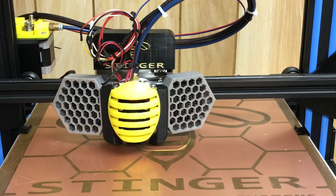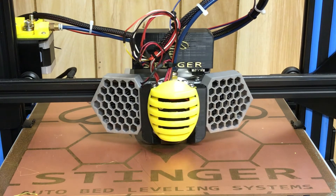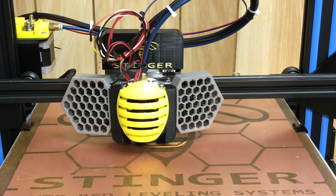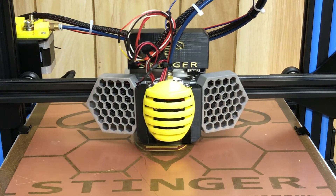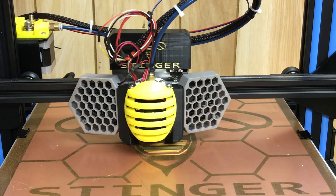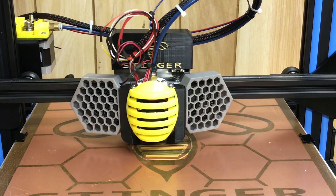This is another thing — it'll give you a good idea of whether your offset is correct. The filament has a lot to do with it — each filament is going to be a little different. I use hairspray because when I'm laying down the fine supports, the real tiny supports, you run a risk of those coming up in this part of the print. How you normally treat your build plate is how you would treat it for this also — it's really no different. This lays down a real consistent first layer.